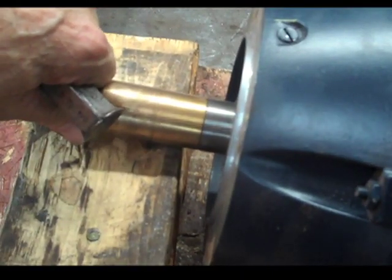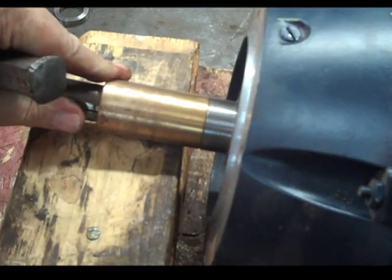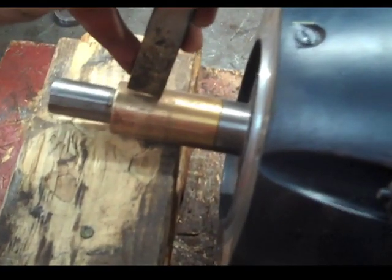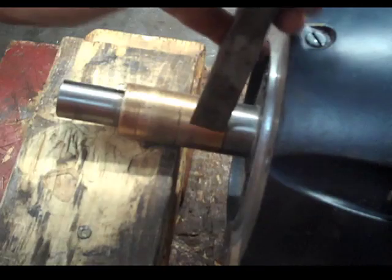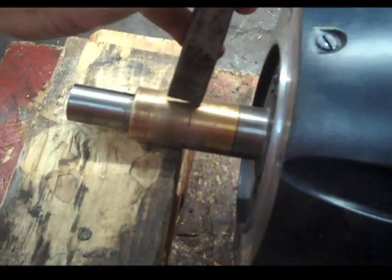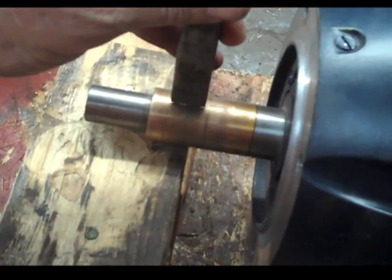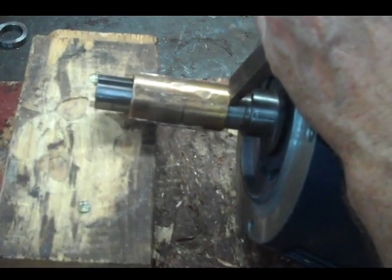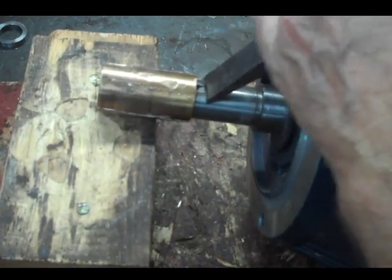Now when you're going to tap on this — and I use the word tap — you want to support this shaft, because when you hit this you're hitting the bearings. You don't want to mess up the motor bearings if you're going to reuse the motor. So we're going to take our chisel, make a line down that shaft. Got this started, and you can see that it pulls off — not super easy but it's doable.